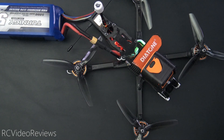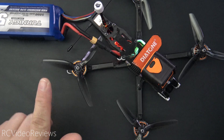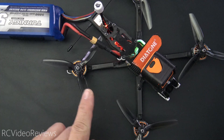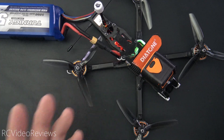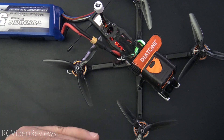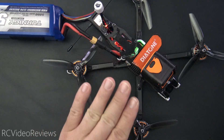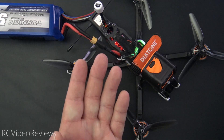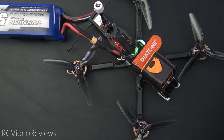A couple of closing thoughts. You can't take a six-cell battery and scale it up. On a lower KV motor like a six-cell, you've got more winds for more volts and fewer amps. You can't scale it up because the motor is not designed to run the higher amps. Higher KV motors have fewer winds with thicker wire, less volts, and they're designed to take more amps. So you can scale a 4S motor down, you cannot scale a 6S motor up. Also, make sure you understand your voltage limitations on your quad — the last thing you want to do is plug 24 volts into a system only designed to take 17, because you're going to let a lot of smoke out.